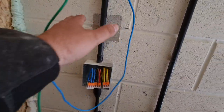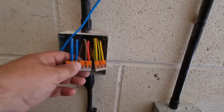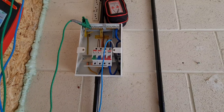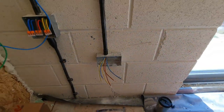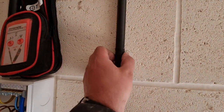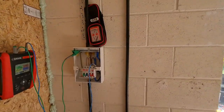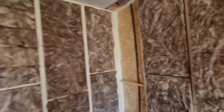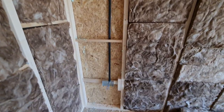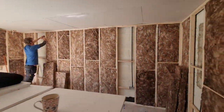About ready to do some testing now. The board is dressed — we've dropped the SWA down a bit because it wasn't cut the best way, so I've had to redo it, then looped through with some 6mm singles up to the new consumer unit. The steel wire armour is cleated with some concrete hex screws. For the sockets I'm using D-line fire clips — all of this will be behind the finished wall surface in the end. There's a temporary pendant at the back, and we've dropped down in conduit to the flush-mount socket outlets.